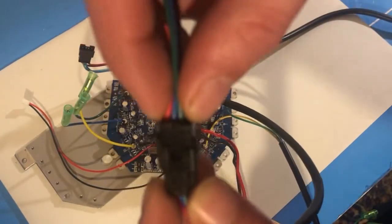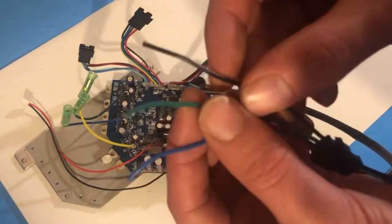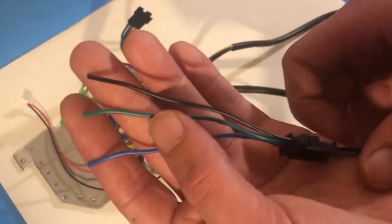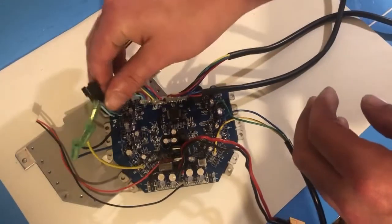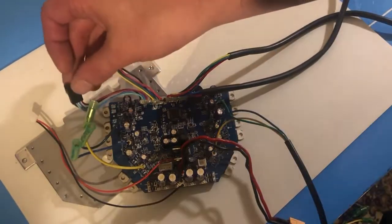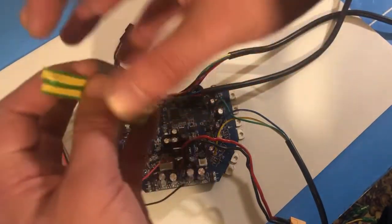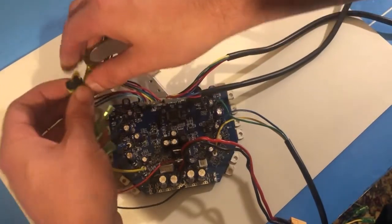As you can see, it's got black, green, blue, and red wires — the same as the cable we cut off the sensor. Once we've got this, we don't have to disconnect the other one. All we have to do is connect the wires we need. Blue and green are used for communication — they go to each potentiometer for steering and throttle. The other switch sense cable we won't be using, so tape it up so it doesn't accidentally touch anything.